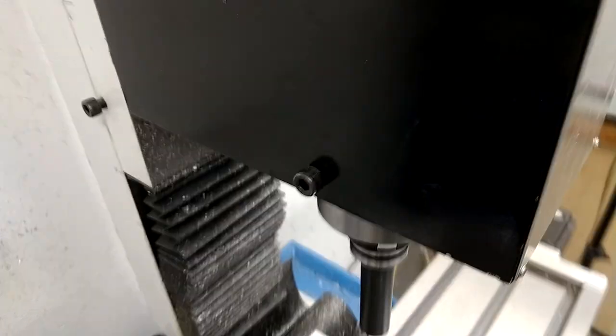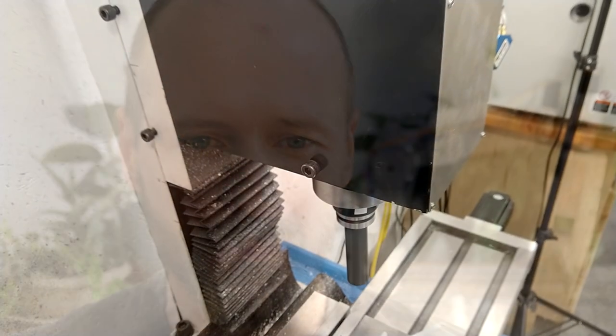After removing the remaining parts of the drill-press-like action including the spring and top-hat spring cup, the bottom spindle cartridge is held in place by a single screw pushing on the side of the spindle cartridge. If that screw loosens the bottom half drops. To fix that, I put the spindle in tension using a custom nut on top of the spindle. Are the electronics for a CNC retrofit expensive? Yes. Increasing expense is that details about each component are often incomplete or inaccurate, so engineering a complete system without tinkering seems unlikely. Incompatible components need to be replaced or workarounds must be created. Maybe that's the purpose of reports like this video — a little bit of information about how a particular combination of parts worked for one person.